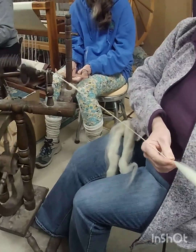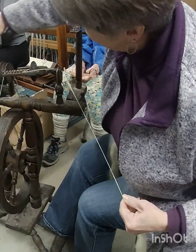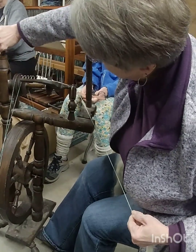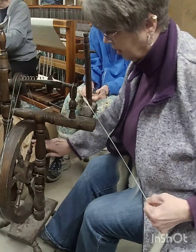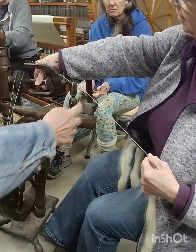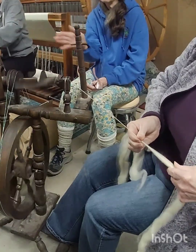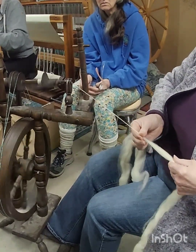Now the magic is going to be whether or not we have any take-up. You see this pole, and it must be there, or you will never have take-up. To get take-up, I have to put more tension on those, and I don't know if we're free enough. Take up means it'll pull the yarn through here, put the twist on the yarn. The key is to let the machine do its job.